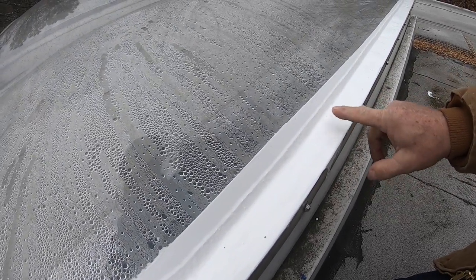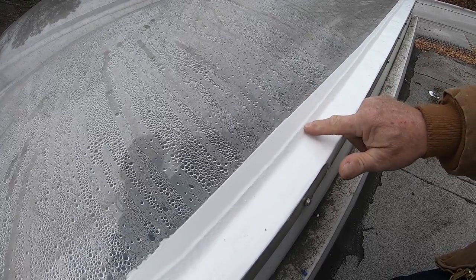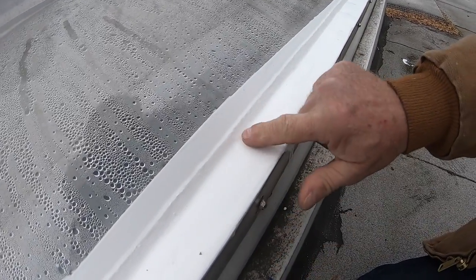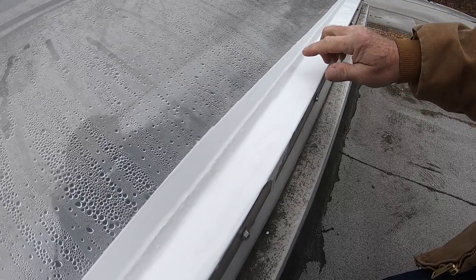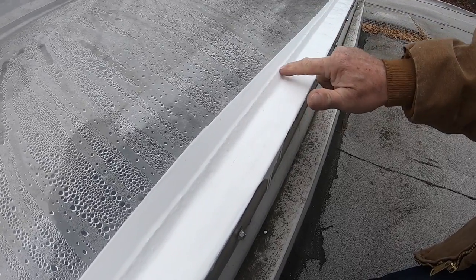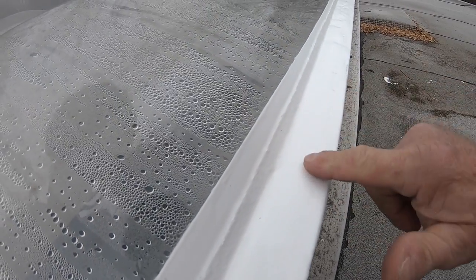There's a layer there, but look at this transition — it's so smooth. Look at it, beautiful. The principle is: I used the fleece. You can see there's the fleece, and the fleece comes through. I only put a two-inch fleece just to cover this gap here. I'm the flat roof doctor — skylights that leak, fix them. You don't need to replace them.